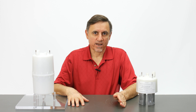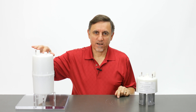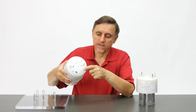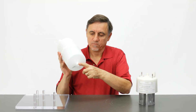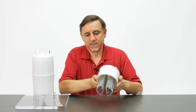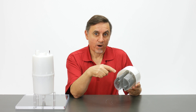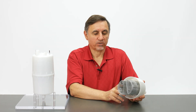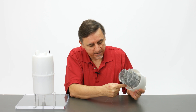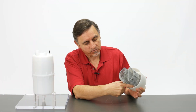A lot of people want to know what these cylinders look like on the inside. We've taken a 202 steam cylinder — we have two of them here, this is what they look like originally. You have on top the two electrodes, a high water level sensor probe, and the drain connection on the bottom. We chopped one open: inside you can see two electrodes basically made out of chicken wire. If this were a three-phase steam cylinder, it would have either three or six electrodes. You can also see the high water level probe, which is a little piece of stainless rod sticking down inside.